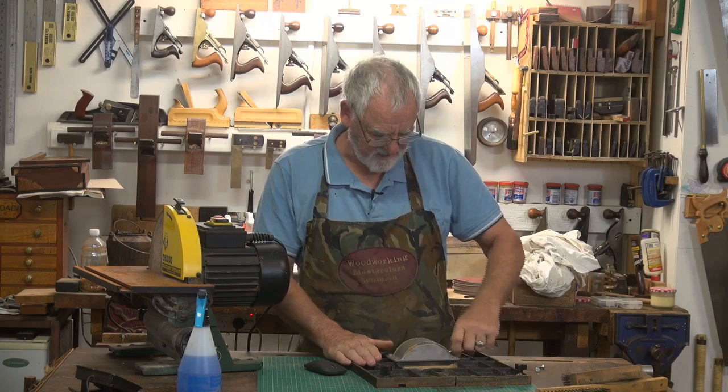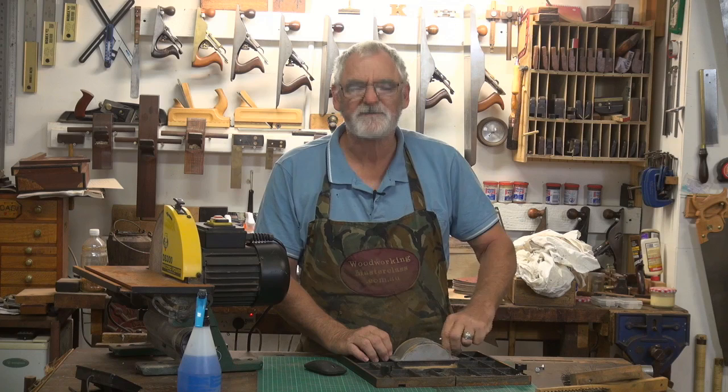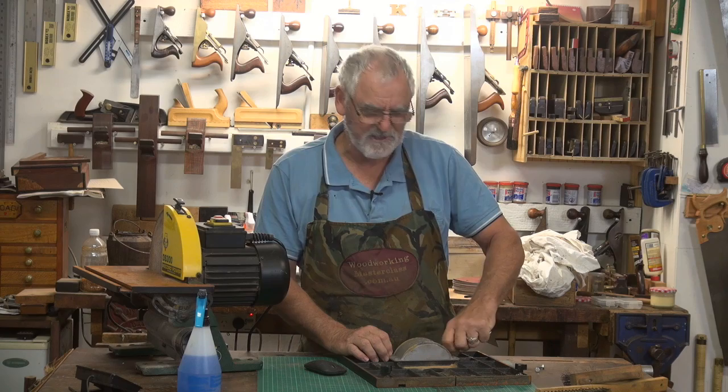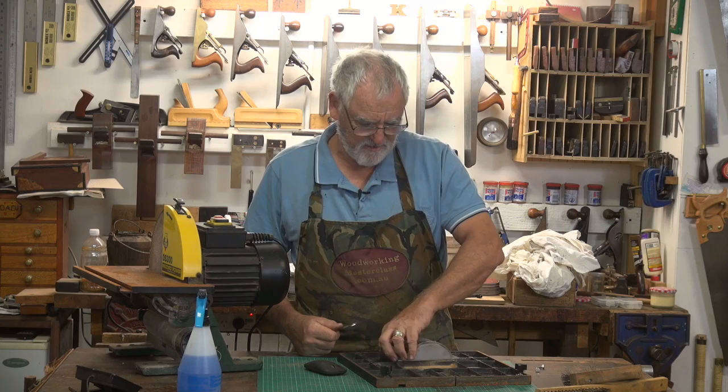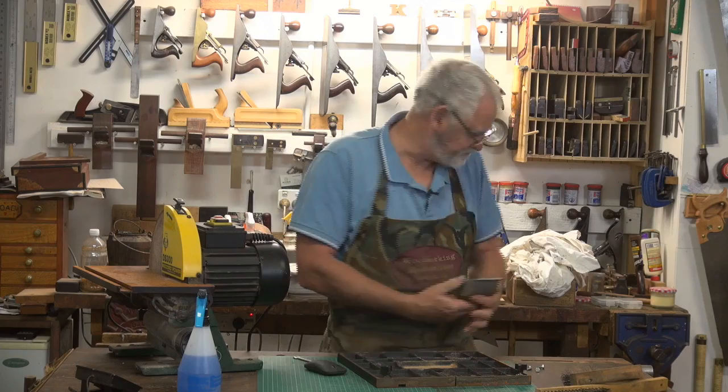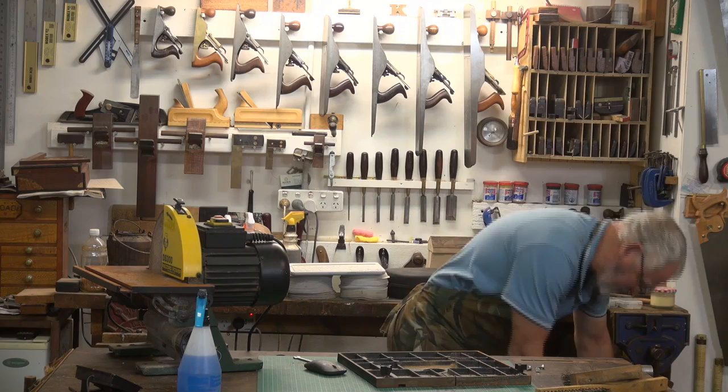So the only reason I'm taking this plate off the back here is so I can sand this flat. I do have a mate that's got a milling table and grinding benches, but quite frankly, this is just surface rust. So I'm just going to clean it off with a half sheet orbital sander and various grades of wet and dry carborundum. I'll just blow that out.